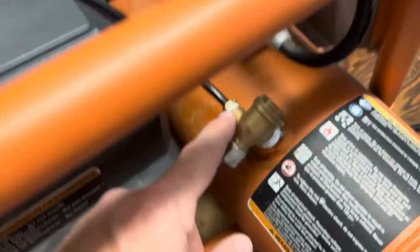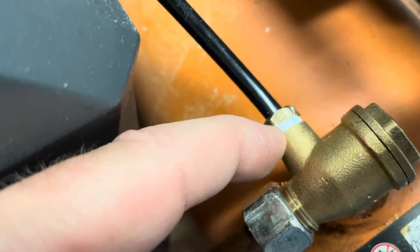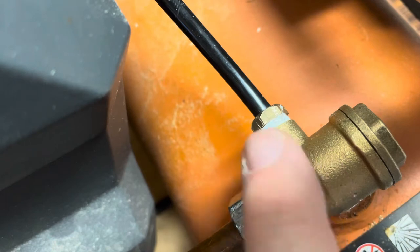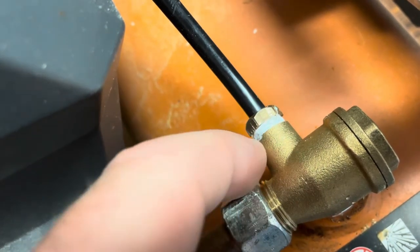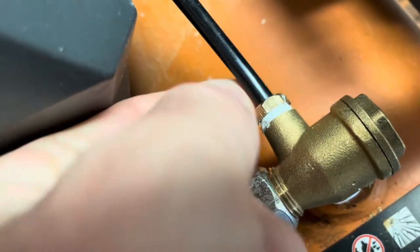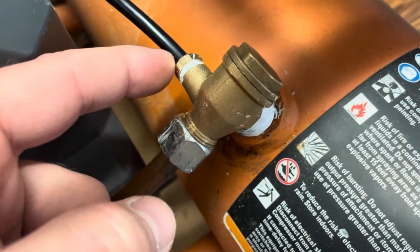You have to look online to see which relief valve fits yours — mine didn't fit exactly. The new one comes with a female and a male screw and has a compression ring. Also, inside the tubing there's a small piece of brass that goes up in here with a flare on the end, just to keep the hose from squeezing and pinching off when you screw this in and tighten it. It's pretty self-explanatory when you get it and it's not too hard — unscrew it, take it off, and this has got a flare so it just goes right on there.